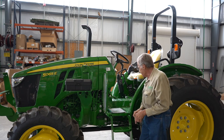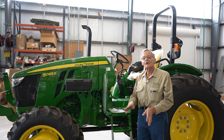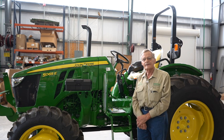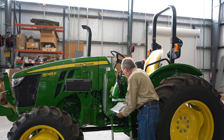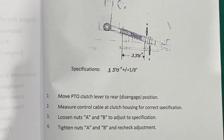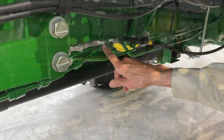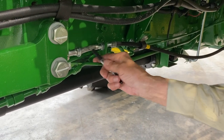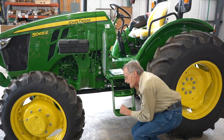The next one is PTO. The complaint was that the PTO is slipping — you hook the shredder to it and it seems not to be cutting right, it seems to be slipping. What we're going to have to do is check the PTO linkage. In the mini tech manual, the last category concerns the PTO and gives specific dimensions as to how the cable must be adjusted — it's approximately three and three-eighths of an inch from the nut to that washer. The specifications are in the manual; you readjust it and retest it, and you'll find that it functions properly.